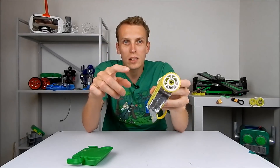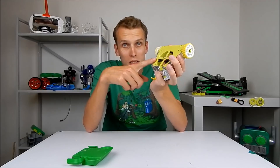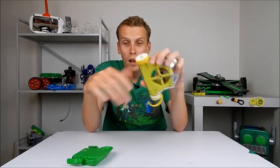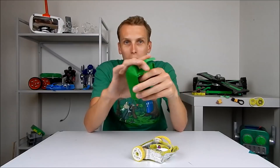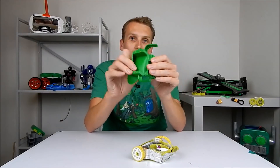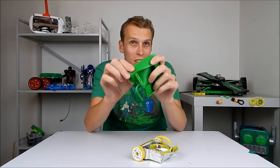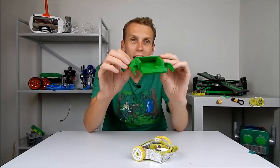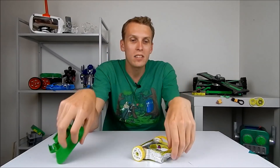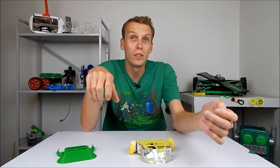So what we're going to do, I think, is separate this into two parts. We'll have a top plate out of ABS as we have here, but then we'll have a wedge and body made out of TPU — the rubbery stuff that Slightly Rubber is made out of. So this new wedge is going to be able to take a hit and survive all of the impacts, because it's sucking itself to the ground and not moving anywhere.